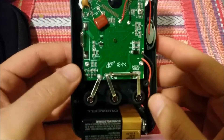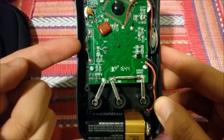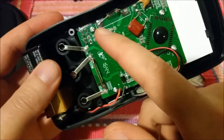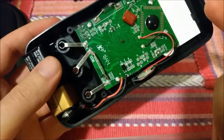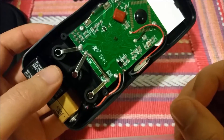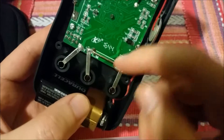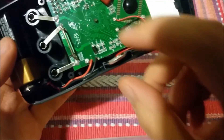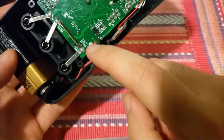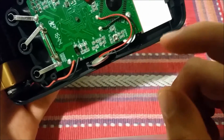But it's the quality that you'd kind of expect. Not even a fuse — it uses what looks like an incandescent bulb. I'm probably going to eventually replace it with a socket so I can put a replaceable fuse in there. You can see a very shoddily done shunt resistor, and interestingly they nicked the metal in order to change the resistance slightly. Pretty much no strain relief on this, so I'm probably going to have to do something about that.